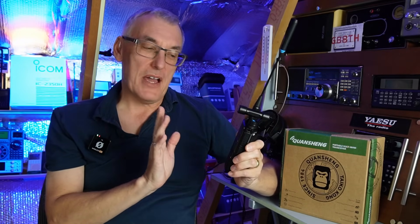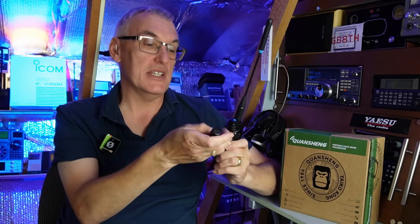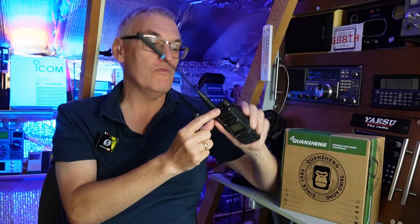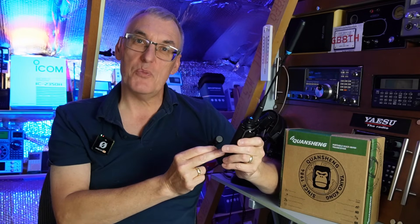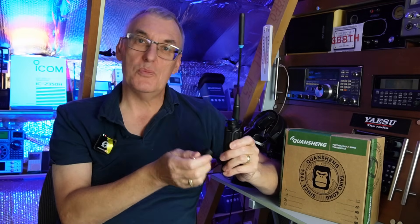The first thing I'm not happy with is the antenna connection for the HF — being a mono 3.5mm jack. It just restricts the amount of antennas you can plug in because it's not a firm fixture like an SMA. I'm not really sure why they did that. And also this little ferrite rod — I didn't get on with it at all. I didn't really pick up anything on shortwave and on mediumwave it was very selective. It's too small and just needs to be about twice the size to improve mediumwave performance.